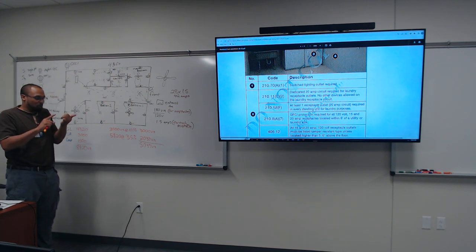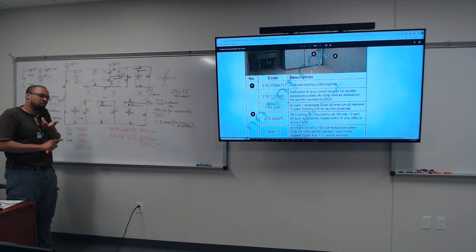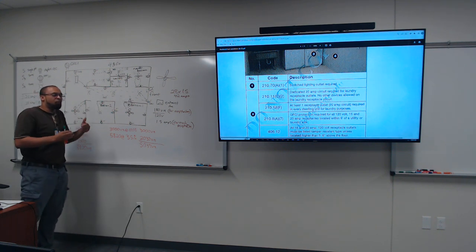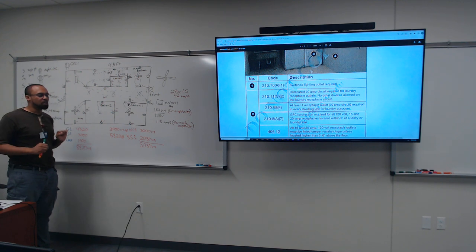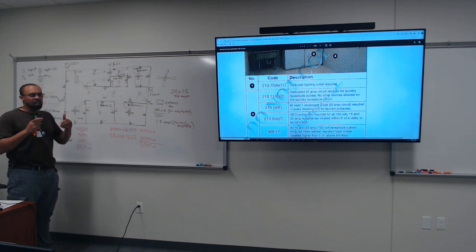But be mindful though, you got to do a dryer, you got to do an oven if it's a 240 oven, the trash compactor, the refrigerator, some plugs, some water heater, you know, double pole. So you got to be mindful. Therefore, when you do go to these homes and they have the lights and the plug, that's okay because it's allowed. But if it's a big home, you got a big panel.